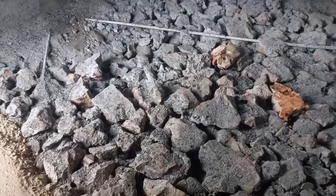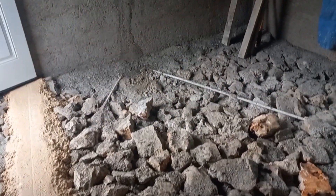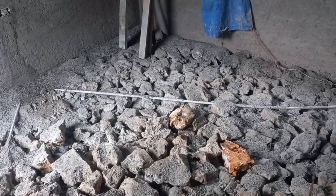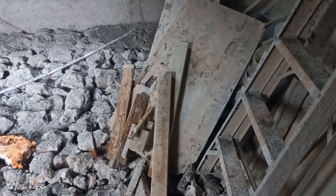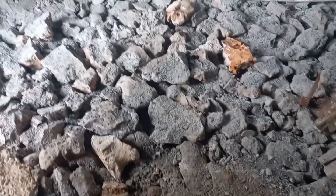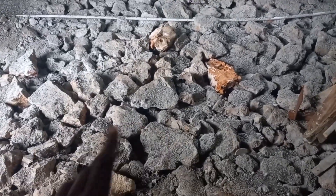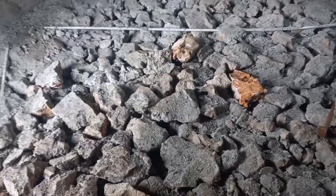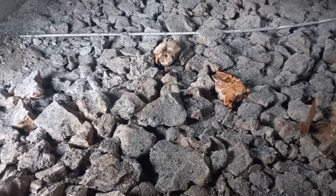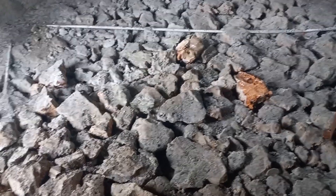We have a screed run already out there, so I'm going to set another screed over there. When ready, take out all these boards and stuff inside here, then we're going to cast this place. We'll get some small fine stones to throw into the gaps and fill them out so there are no voids in there — everything blending and refined — and then we cast it.